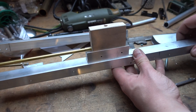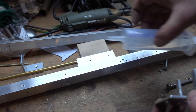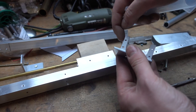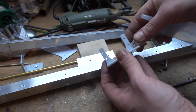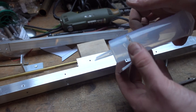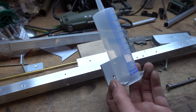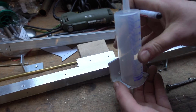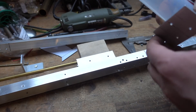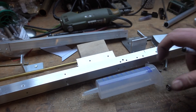It goes in here, and now you have, so to speak, your receiver and your barrel already on. Next is the syringe. I made a cut — it's a regular L-shape — just with cut-outs here for the springs. I don't want them to touch it because they lose force just a bit. Then you just drill holes where the syringe is hitting it, mark them, drill holes, attach it. Then you can attach the U-section, put in the syringe and screw it on.